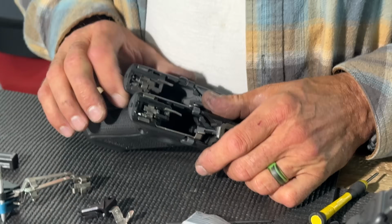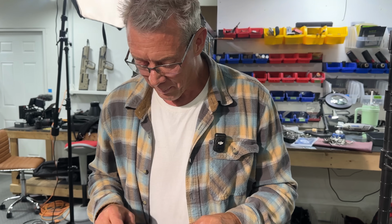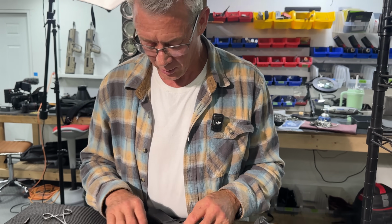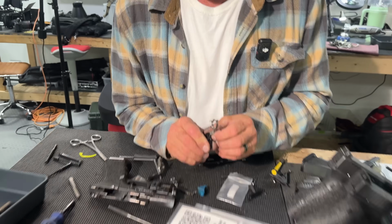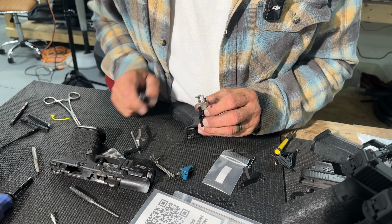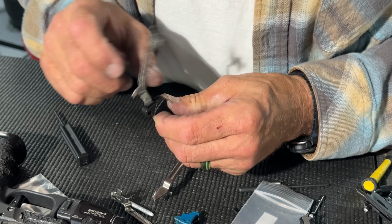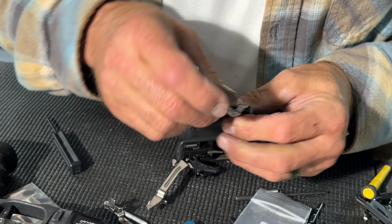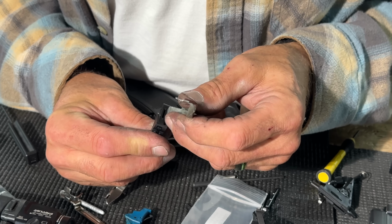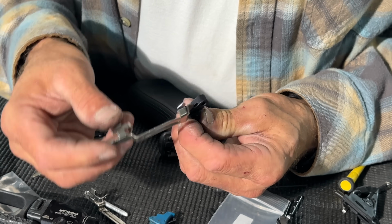And so now if I'll do this quick. What's stopping the Johnny Glock trigger bar is either A, the set screw, or B, the limitation that we have right there. So if I would take a Glock bar, you would see all this movement back and forth and how it almost goes all the way to the back of the shoe right there, all that movement right there, you just don't have that on ours.